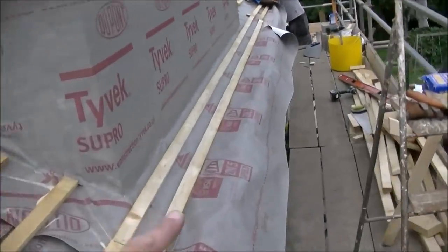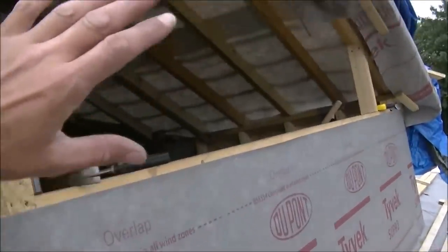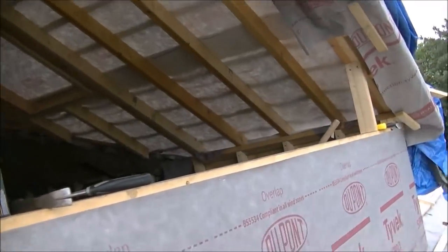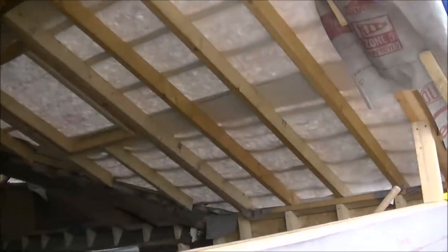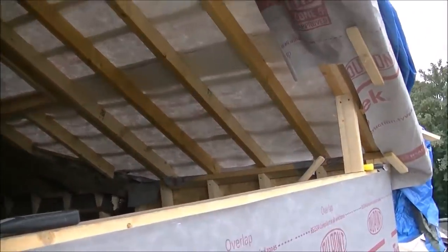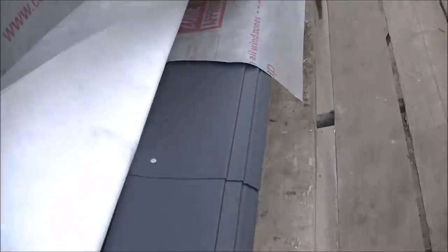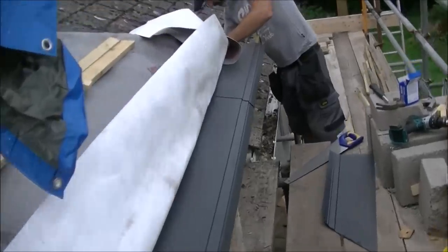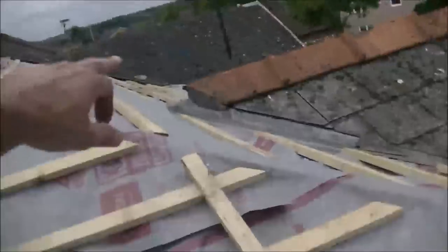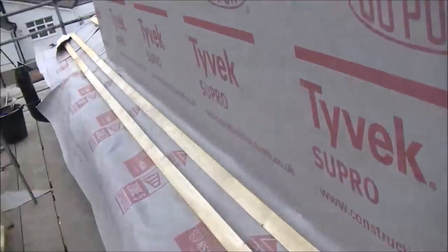If we look down the length of here now we've just added these battens. We felted the base of this dormer — we're not going to do the top of the dormer for now because I need that access space to get large boards through like my insulation and plasterboard. We'll copy this section over on the other side for now and probably eventually start covering up with large sheets of OSB boards at night, and once the stairs are in I can access from the inside. We've done the felt support trays all the way along underneath. I've got a few more materials to buy before we carry on with the other side of the roof, but we've got the side and front of the house done. So there's no reason why I can't start slating sometime soon.